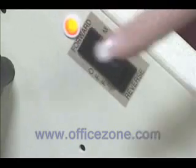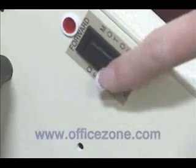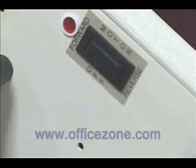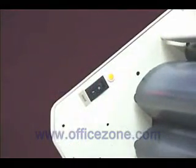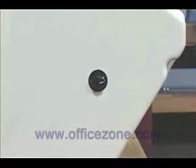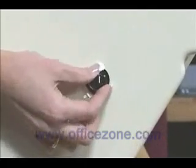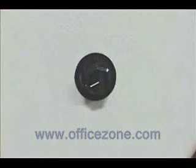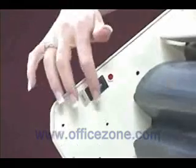The motor control switch is located on the right side plate. The heater control switch is located on the left side plate, and your temperature control dial is located on the left side cover. Go ahead and adjust the temperature control knob to about halfway for a good starting point.